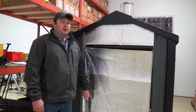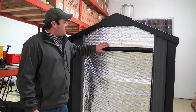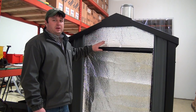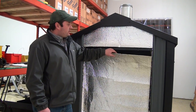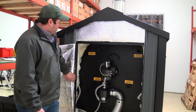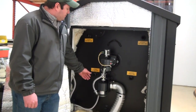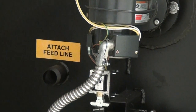We're at the back of the stove now on the 7300. A couple things you're going to notice first is the large access door in the back here. There's plenty of room to install a minimum of two pumps on the back of the boiler — a very large area to do all your plumbing, with plenty of room for both of your blowers and your solenoids.